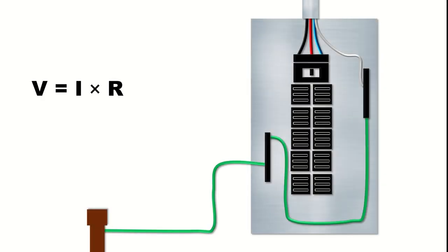This is how a grounding system with a direct and physical connection to the earth can serve as a zero volt reference point within an electrical circuit. In a phase-to-neutral configuration, the neutral is intended to provide a zero volt reference for the supply voltage. While a perfect grounding electrode system would have zero ohms of resistance to the earth, the neutral voltage would be above zero for an actual grounding electrode system. In that case, the voltage difference between the neutral and phase could be lower than the equipment's optimum operating voltage.